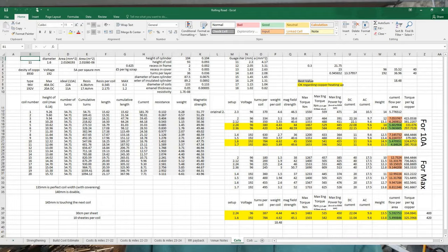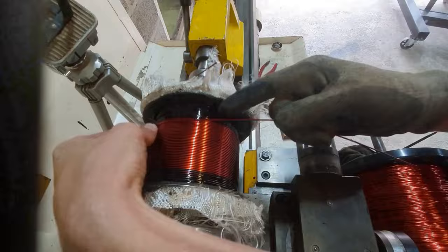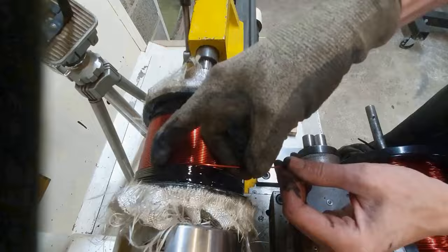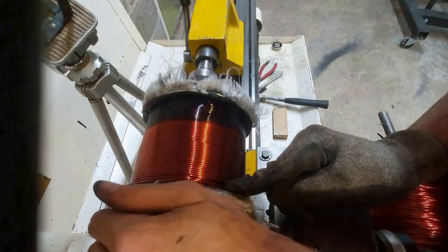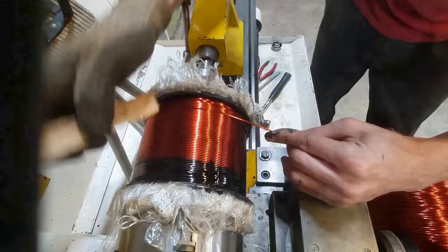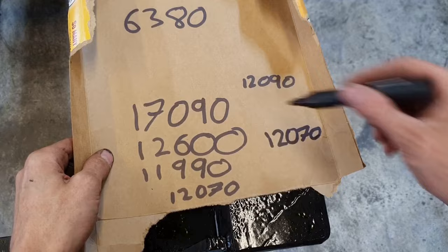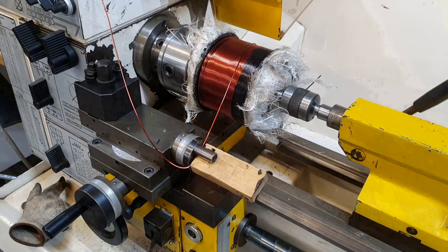You can see here some of the pages of calculations I've done - nobody cares, right? Stay tuned to the end if you want some scientific detail about materials and the calculations. It's going on in quite a satisfactory way, and I did learn it's essential that it stays neat - work hard on the ends, the ends take ages. Winding the centre is quite quick. I'm approaching a point where I think I've got close to five kilos. I leave the coil on the lathe and weigh the spool - around 500 grams remaining, so around 5,000 grams has gone, which means I'm confident enough to cut the copper now.